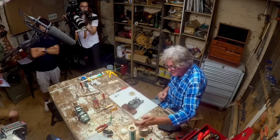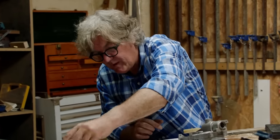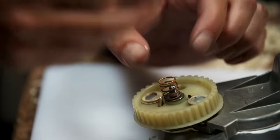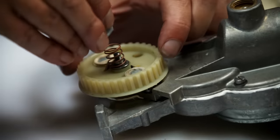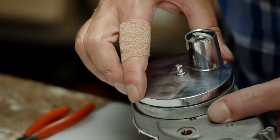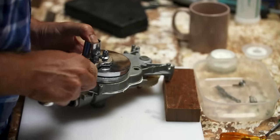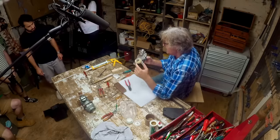This is the little clever dog clutch bit. The end of the shaft with the pinion on it that drives the gearbox is threaded. This is a dog clutch — a clutch that engages not progressively like the multi-plate clutch of a car, but simply with flat bits which go clunk onto other flat bits. There's the flat on there, there's the flat in the epicyclic hub, that is an iron washer, that is the securing nut which will have to be nipped up. That's the main gearbox bit of it done. I enjoyed that. Mechanisms — they're nice.